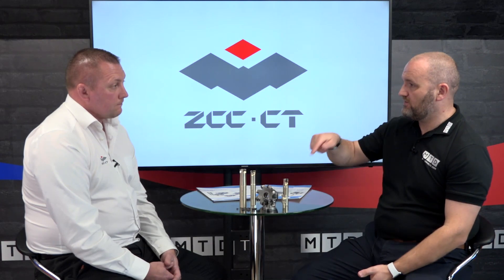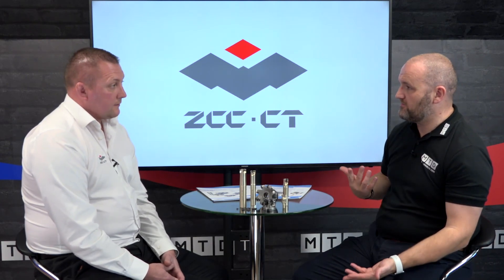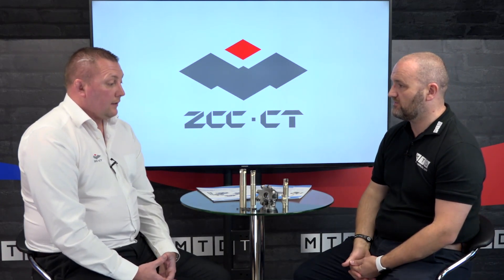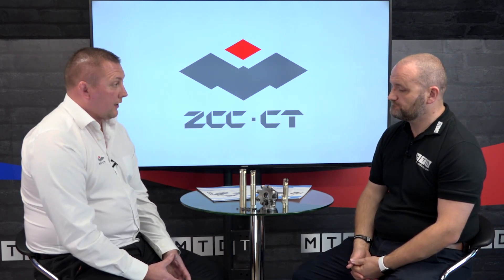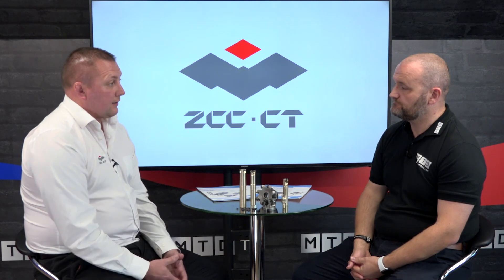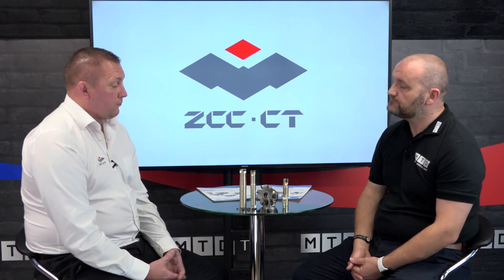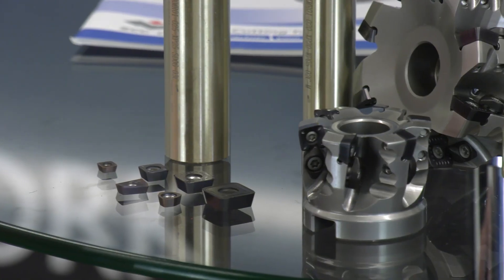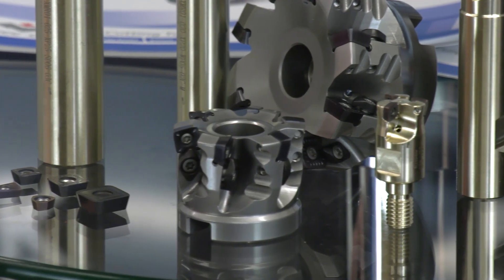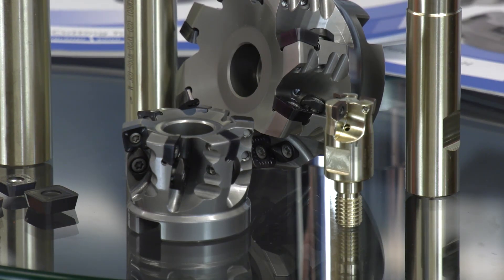And there's probably an advantage if you're doing helical milling because you're finishing as you're roughing out on the sidewall. Yeah, you can sidewall a bit as well, so when we're pocketing in from solid we mill down and it produces a decent enough finish. And this is more what I would class as a traditional Hi-Feed mill. I notice you've got clamps — do you see that as a disadvantage?